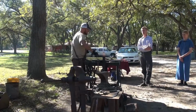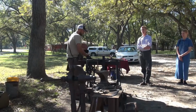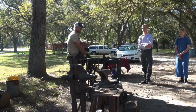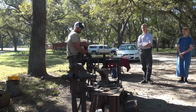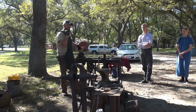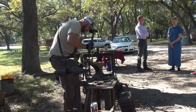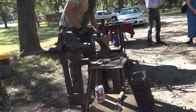So this fire pot, this is all coal. This is Oklahoma coal. It's why it smells so bad. It's got a lot of sulfur in it. You can get Wyoming coal and the Kentucky coal. It burns a lot cleaner, but it's kind of hard to get from around here. So now I'm going to open this cross up, kind of get the wings set on it.